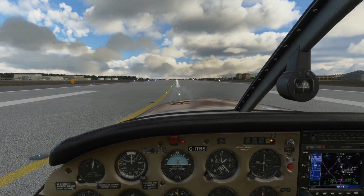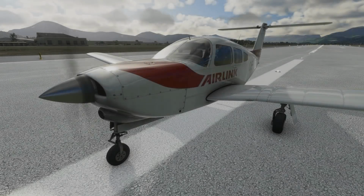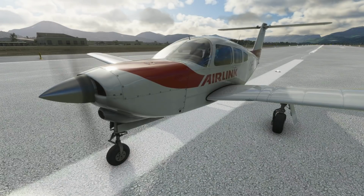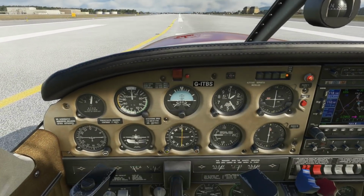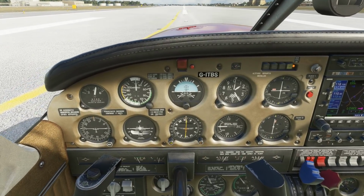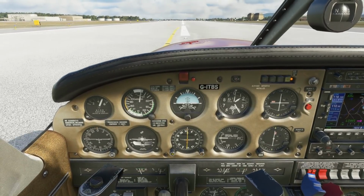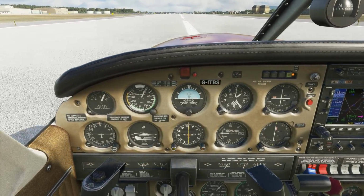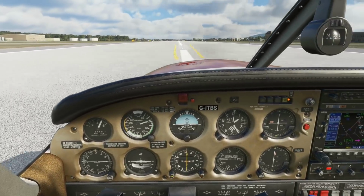And runway 33 is confirmed on the compass and on the HSI. So we are all set and ready for the departure. Feet can come off the brakes. We'll come up to 40 inches on the manifold pressure for the takeoff. So power is set, RPM is checked, T's and P's are in the green.